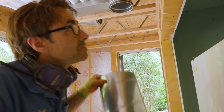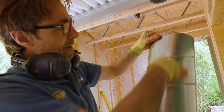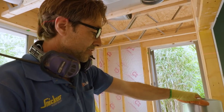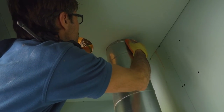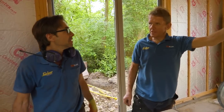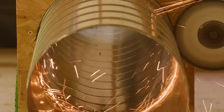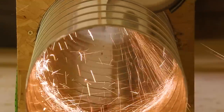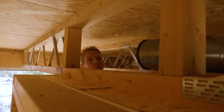We've got four equal duct spigots here, roughly three times the diameter — there's a note in the manual that says the minimum for the extract is three times the diameter, so I've based all of mine on that. That looks absolutely perfect. We worked out the duct length together at 570mm; we'll give it another five mil so everything is just absolutely perfect.